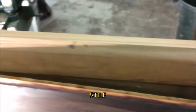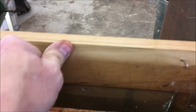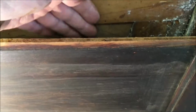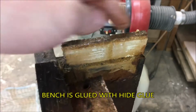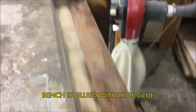This one rail is splined into the side, so that's separated right here, which is not a big deal. Now what's unusual, there's an inner and an outer back. This is the seat back right here, and this is the back panel of the bench, so there's a space in between, and there was a few nails holding a glue block in. That's split, but I can glue that back together. The front rail was glued in with a mortise and tenon. Just soaked out with some alcohol, and a few minutes later that just separated.